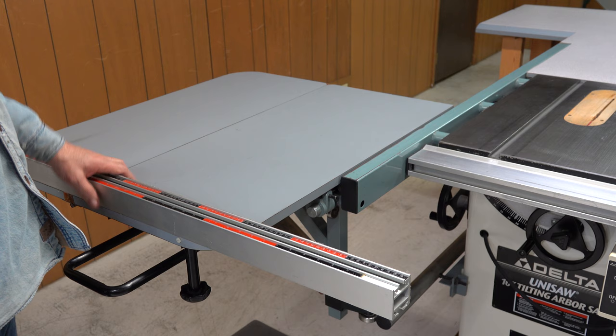And number 17 is a featherboard for the fence. Now, if you have a little back hook or a way to get onto an extrusion, it's pretty simple to make these. All it is, it's clamping down on the profile of your fence. That's it. A couple of bolts are behind here within a slot. And again, when you're doing something that has to be held against your fence, you want it to be held down to the table, otherwise your dados or your rabbets are going to vary if your wood has a little bit of warp or what have you. So when you're running a whole bunch of pieces through, this is a huge help to be able to do this.